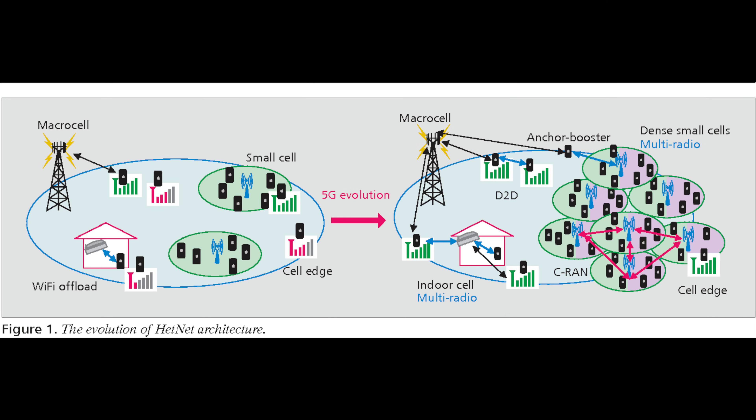This is very unlike the lower band 5G, which is 6 gigahertz or below and is more long range. If you live in a big city you'll have better chances of connecting to that 5G millimeter wave technology; however, if you live in more rural areas you're going to have to stick to the lower band 5G. Another thing about 5G millimeter wave technology is that it can be obstructed very easily by doors, windows, trees, and walls — that's why it requires so many 5G towers being installed in areas where that millimeter wave spectrum wants to be used.